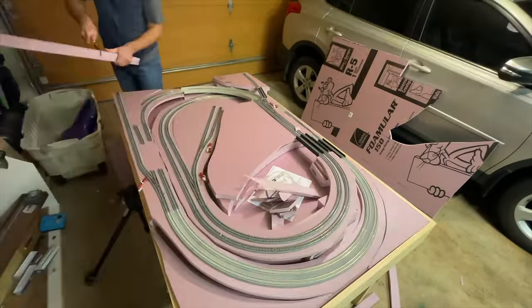To hold the Zephyr base station, I used 2 strips of Velcro on the back of the Zephyr unit, and then ran 2 horizontal strips of Velcro on the wood panel it was mounted on. And to make sure that adhesive Velcro wouldn't pull off over time, I attached each strip with 3 additional screws as well. That would securely anchor the Velcro to the wood so it wouldn't pull off at some point down the road.